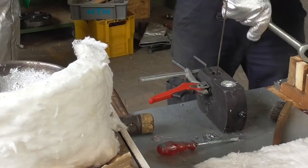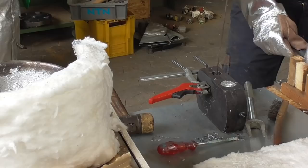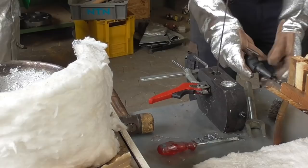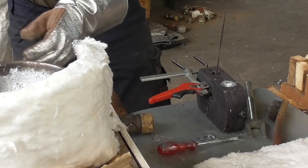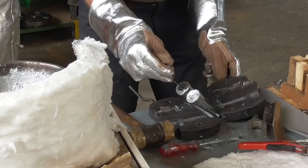While the casting cools down a bit more I am already preparing the next core with the stick and put it near the oven so it keeps warm. Then I adjust the stick out and put it aside. Opening the mold with a few blows of the mallet — this time I was lucky and it directly fell out. Normally I have to use that abused screwdriver to get the casting out.